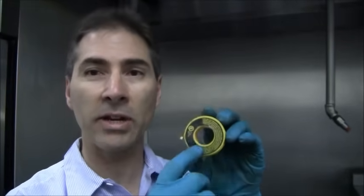Also, for the tape — because it's a natural gas line — I'm going to use yellow tape. The standard plumber's tape comes in a roll like this and is white in color, but it's not rated or used for natural gas lines. If you're working with natural gas and you're going to use Teflon tape, you use the yellow, which is rated for gas. It has writing on it listing the ratings: gasoline, natural gas, propane, and so forth.